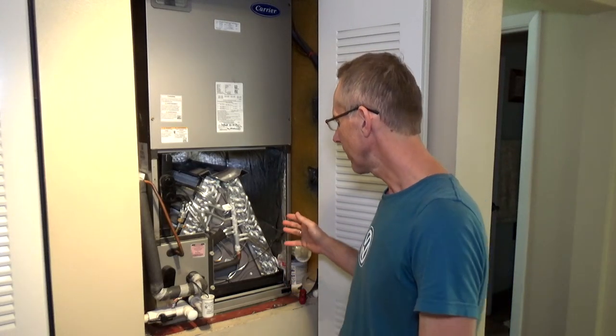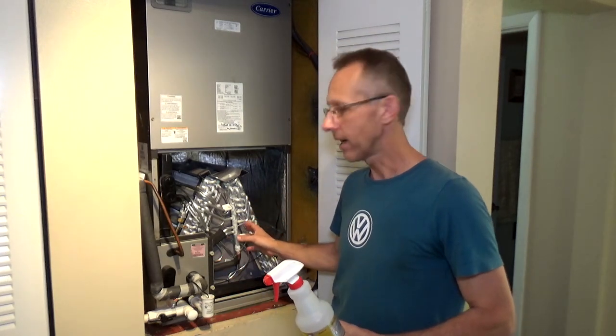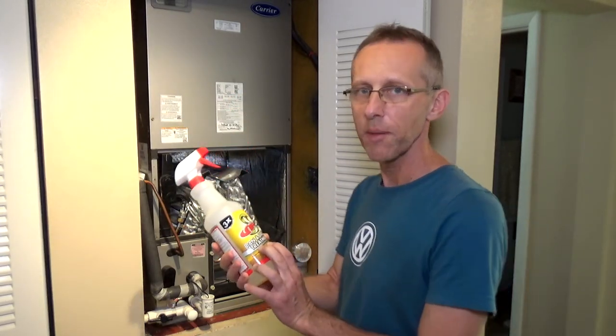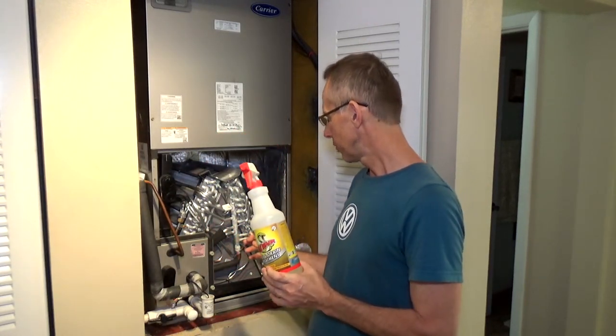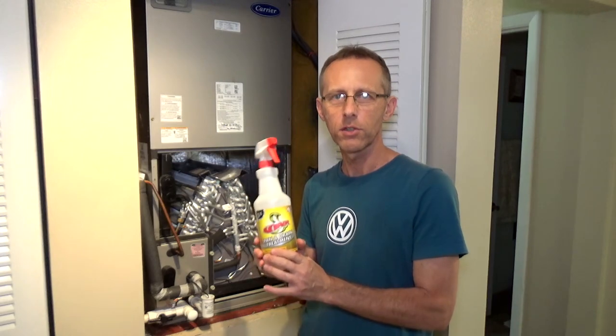Those are three simple ways to detect AC leaks. If you let your AC run without freon, you're going to damage your compressor and have additional expenses. Also, after installing my new AC unit, I use Viper pan and drain treatment — I spray it in the pan and underneath on the coils. It prevents algae from clogging the drain for about six months. I use it in all four of my units and it works really great.